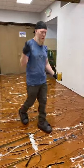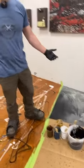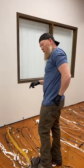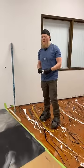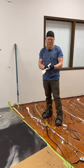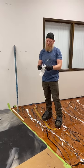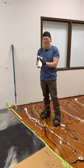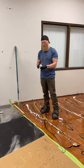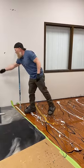I'm excited but also a little scared about what I'm about to do. Are you wearing a mask? The reason I'm not is this product is a true zero VOC, 100% solids product — there's no volatile organic content evaporating to cure it, zero odor, and we're in a well ventilated room. But just because companies advertise that does not mean you're safe. Always look at the SDS, because many times companies put in about 3% of very harmful evaporative products — 3% being the threshold set by lobbyists and the EPA and FDA. We don't want that.